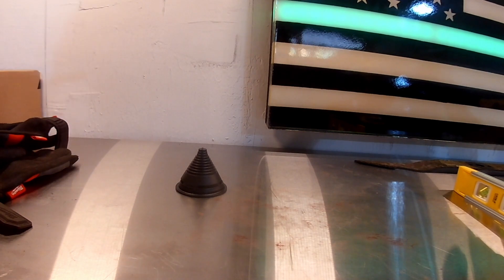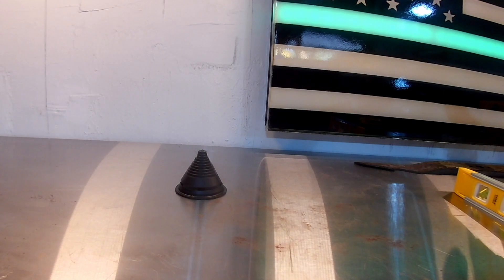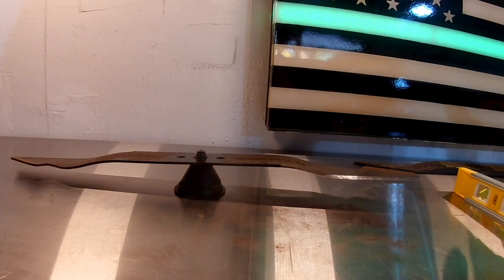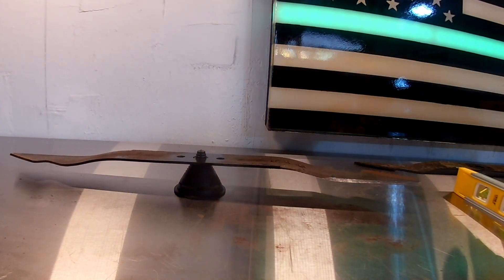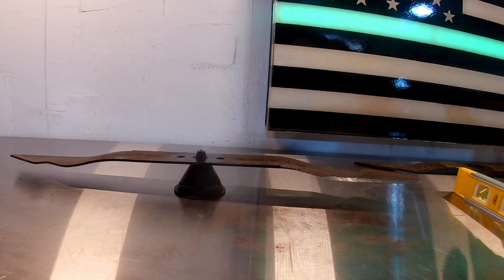I'm going to take the level away, move my gloves out of the way, and remove any obstructions. Now we're going to see if we can level it. You can see on the left side I haven't taken off enough — the right side is a little lighter, so it's not level. That means we're going to have to go back and take off more. Just keep track of which side you're taking off more material — it doesn't take much to throw the whole thing off balance.